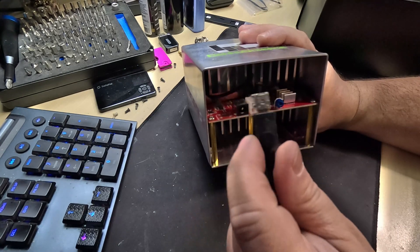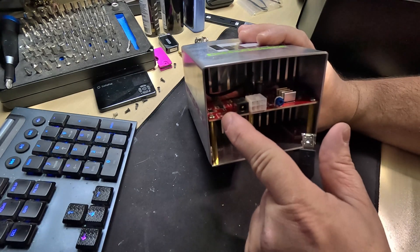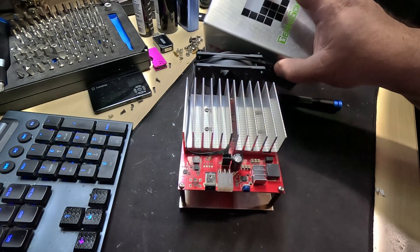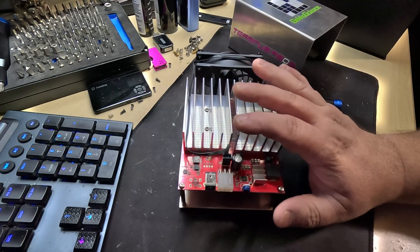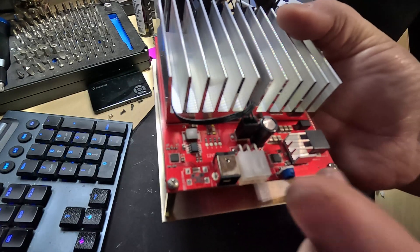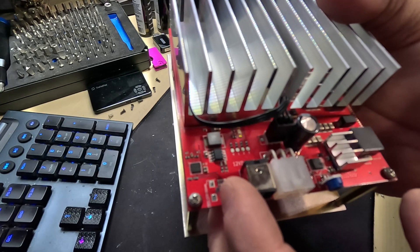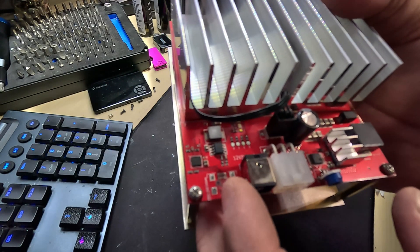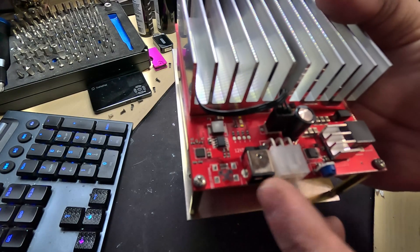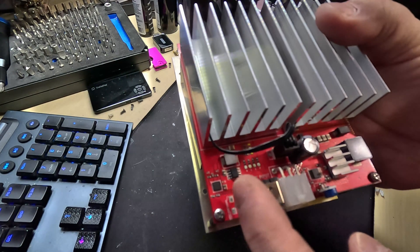So that's what I'm going to be doing today. It's actually still connected to the cable. Let's get this apart and get the circuit board out, so this way I have more area to work with. I got the top cover off. At first glance, this might be a very easy repair because none of the five pins for the USB 2.0 — the pads are all still there. They haven't been ripped off, and same with everything else.